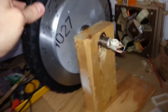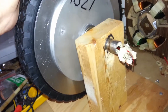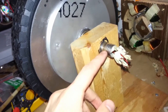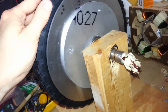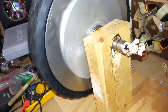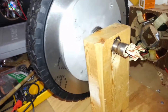That's bad for a couple of reasons — one is it's putting force on the shaft. At low speed, the shaft turns with it, so even if something is stopping it, there'll be resistance at low speed. It won't be able to turn at a very low speed unless it has very high torque. There are two ways to get around that: one is to brute force it, like what I'm doing.